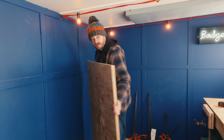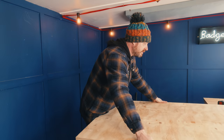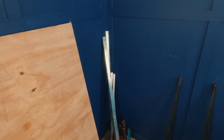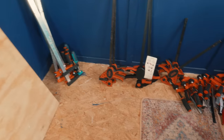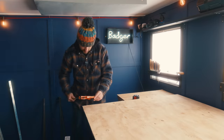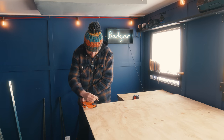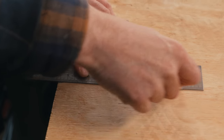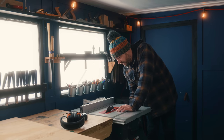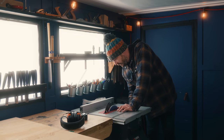This thing is not going to be very complicated. I've got some 18mm ply to make it out of. I've dug out all the clamps I've got and I'm going to start with making a rack for the longer, biggest ones so I can work out how deep I need it to be. The clamps are pretty chunky so I'm going to go for 18mm strips ripped down on the table saw.